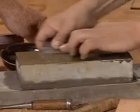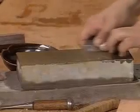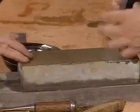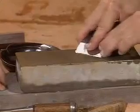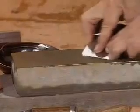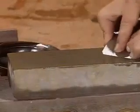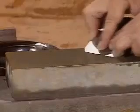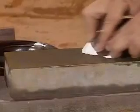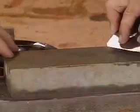This is probably equivalent to around a 30,000 grit stone. And the stone is called a what stone? Honyama. Honyama, and I imagine this is quite a valuable stone. It's quite valuable. The natural stones, I don't suggest them for beginners or intermediates. No, they're very expensive, and they require touch, and also a lot of knowledge. You have to know what kind of stone you want, hard or soft, and you can see how it's building a little paste. I see it. Yeah, there's a little darkness coming. That's the steel particulate. Even with a stone this fine, it's cutting really nicely.